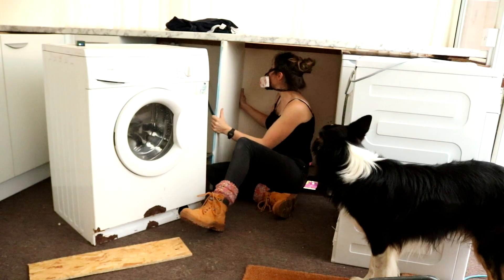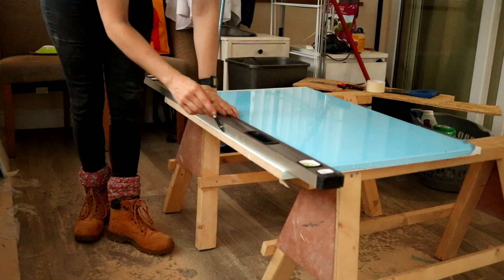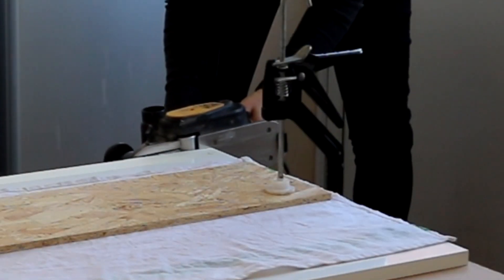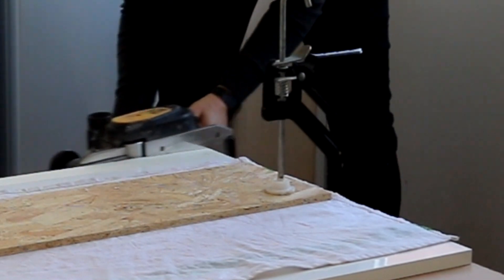When I put it into place I realised the wall in that section wasn't perfectly straight and the panel was protruding a little too much. The high spot in the wall was towards the bottom, so I trimmed a bit more off and popped it back. I got most of the work done on that one, then moved on to the last one. Occasionally I'd trim any high spots off with an electric plane, and on this one I also had to cut notches out for the plugs.